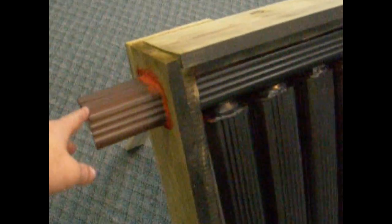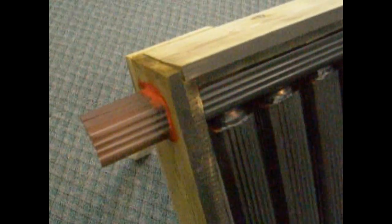Here it is all painted, just ready for the glass. If you notice, I'm coming out the side with my output — my headers here. I'm doing that because I'm mounting this away from the house and I'll have to pipe back to the house. But as you see, both headers will be exposed to the sun too, so everything should be heating up — all my metal should be heating up. Now if you're going to come out the back and you wanted to use a downspout, I would have used a three inch downspout for the header, because that'd give you a bigger hole — at least a three inch hole you could cut in the back. Or if you wanted to, you could do the gutter like I did on that fourth one, and that gives you plenty of room to cut a four inch hole if you need to.